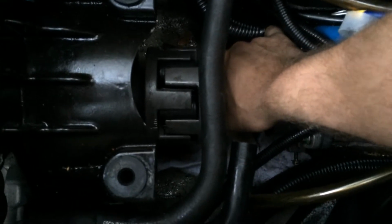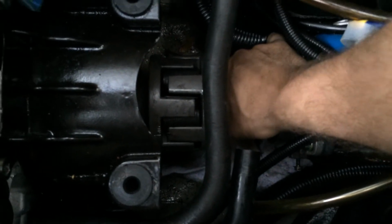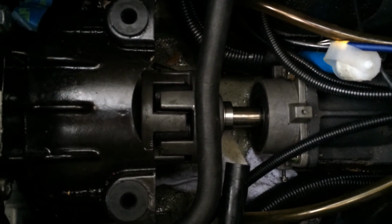And as you can see, this coupler, whenever you've got the dampener and these couplers and they're pushed together, there's no play. I'm actually trying to move them and I can't. There's zero play. We're talking not even thousandths of an inch. None. No rotation, no up, no down, no side to side. So when you bolt the pump on, it's fixed. That end of the shaft can't be adjusted.